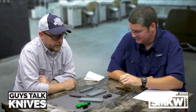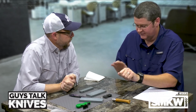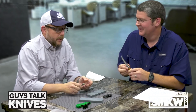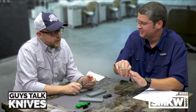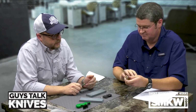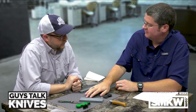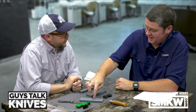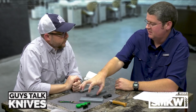That makes a lot of sense. Yes. So while you're doing that with a stone, I would do one side, lift it up and run my fingers up the opposite side, and you can literally feel it. That's great. And that's how you know that your main edge bevels are meeting, and that's when you know I'm done with rough. Because I've shaped it down to where they reach a peak. They meet at your point. And then I'll start going to the fine, because this is removing metal, and this is starting to polish.